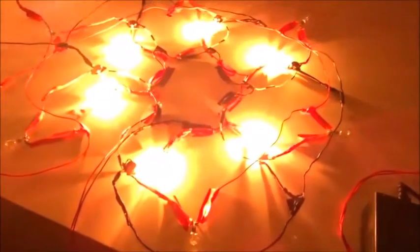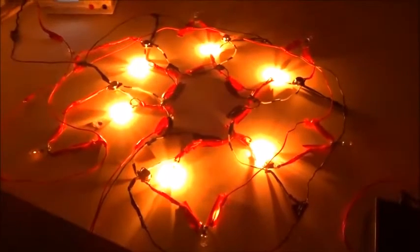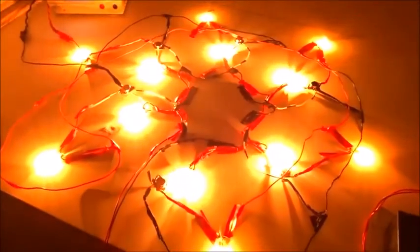If we don't apply any bias voltage from the collector-emitter — just zero volts on the outside — then only the inside six bulbs light up. When we add two volts to the collector-emitter part and turn the thing on, we see they light up a bit weakly. When we go to five volts, they light up very brightly. There's really a lot to study here. Beautiful, isn't it?